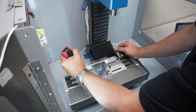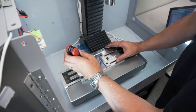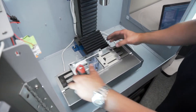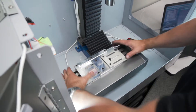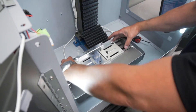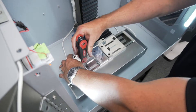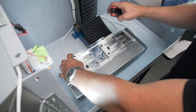I like to tighten them and then back them off so I can slide in for adjustment. I'll move the clamp either all the way forward or all the way back — that's the simplest way to start. I like to do it all the way forward, just my personal preference. Bring it all the way forward and you'll see both nuts snug up there. We're going to snug the lower left one for right now — just snug it, don't overly tighten it.